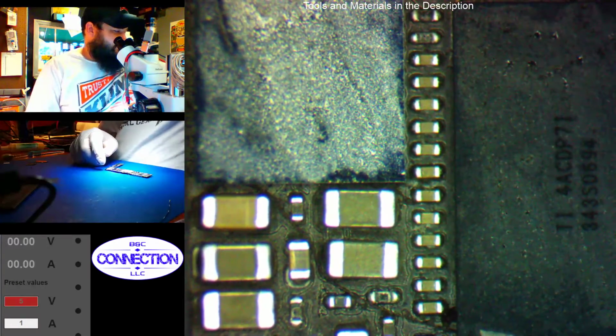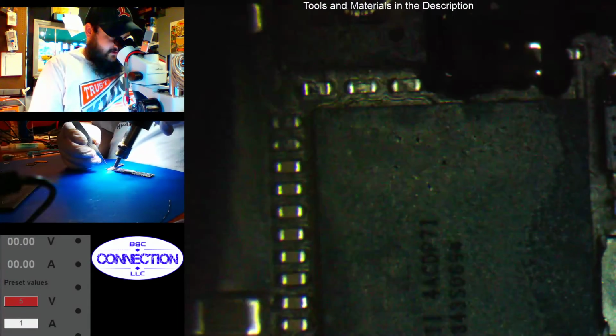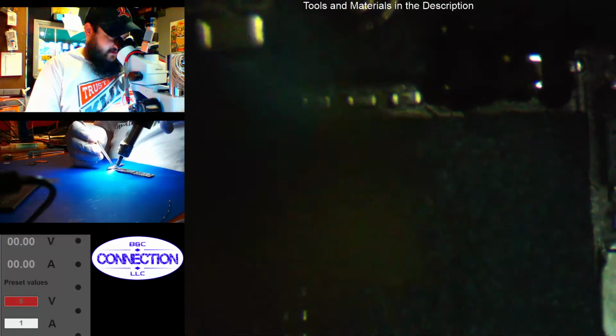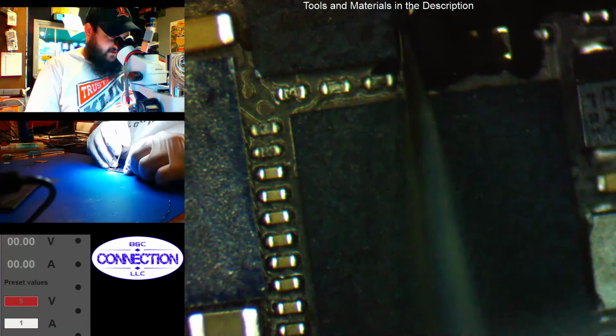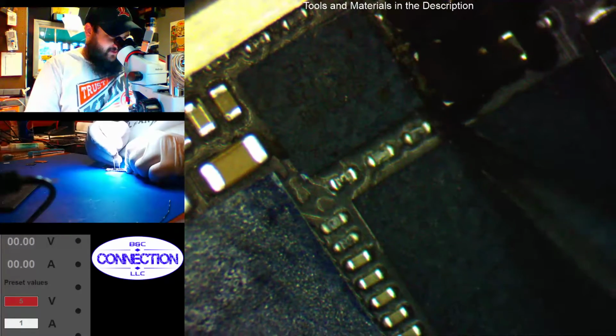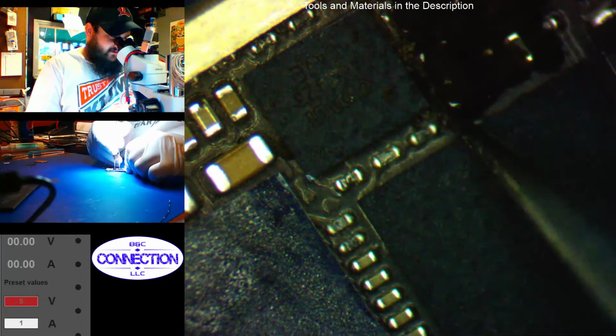First things first, whenever you're going to pull the NFC chip off, first of all, I'm going to lower my airspeed a little bit. You want to clean out this underfill here, next to it, because it will cause issues. Look at that, nice bubble under the plastic coating there. I'll be honest, in most situations, the NFC chip is just a pain to deal with, so I don't even put it back on. Some people use Apple Pay though, so I'm sure somebody will get upset eventually.